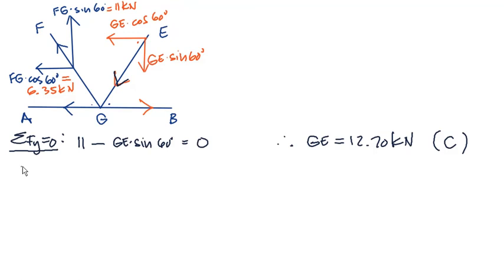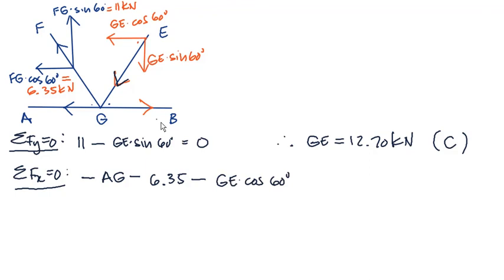Right, now I'm going to solve horizontal to find Gb, the sum of the horizontals is equal to 0. How many horizontals do we have acting? Minus, minus, minus, plus. We've got four horizontal forces. It doesn't matter the order, just take them all. Okay, I'm going to go clockwise. So it's minus AG, minus 6.35, because I know the answer already. Minus Ge cos 60, plus Gb